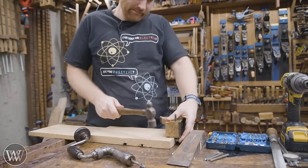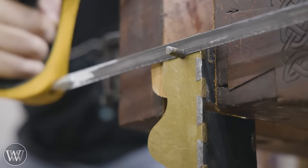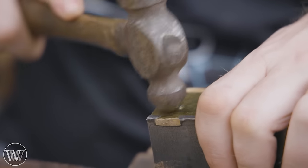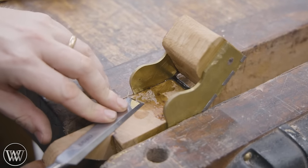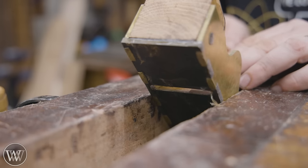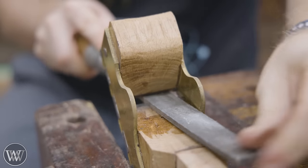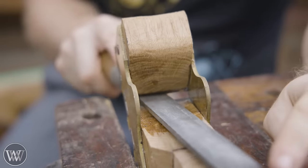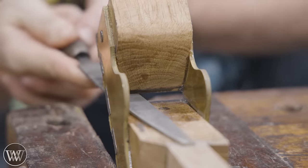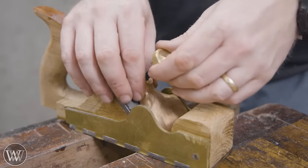Then we can drive these rods all the way down through and out the other side. They are a bit of a tight fit — I left them intentionally just a hair over the size of the hole. We pound them down through, cut off the excess, and leave a little bit sticking out so I can come back and peen it over. This is why you have a ball peen hammer — it will mushroom the head and squish it into that chamfer we just cut. For the body, I want a good clean transition, filing away epoxy sticking out from the mouth into the wooden body. I'm going to leave the mouth closed for now; filing the mouth open will be one of the last steps, just enough for the iron to stick out a little bit.